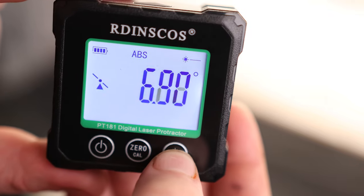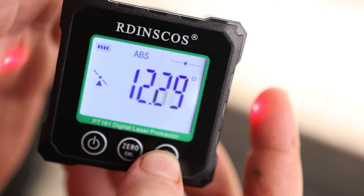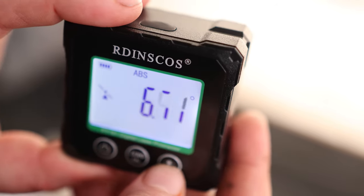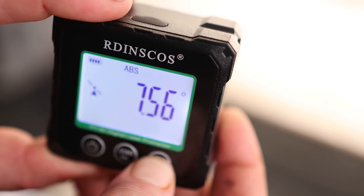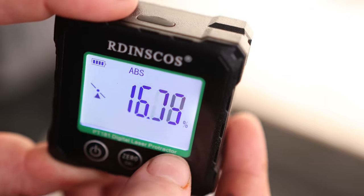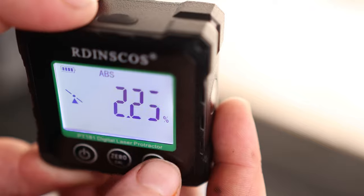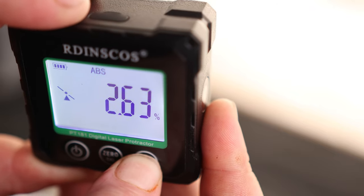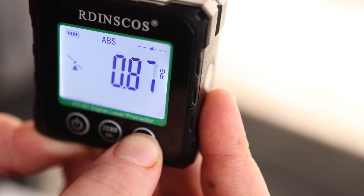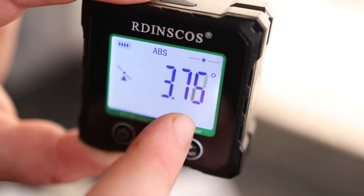And then there's the unit button — that's actually changing which laser is on. So right now we've got both lasers, then just right, then just left, and none. The instructions say we should be able to use that to change units. So now instead of trying to convert from degrees to percentage, we can just use percentage — we're looking for a 2% slope, so right about there. We've got degrees, percentage, millimeters per meter, inches per foot, and then back to degrees. That is awesome. That makes this a very nice gauge.